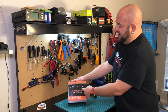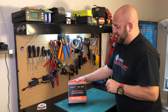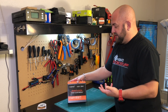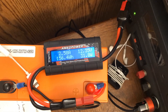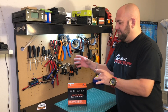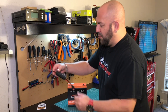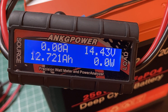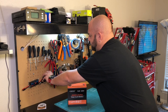This battery is garbage - it just doesn't live up to its potential. I didn't have high expectations, but it's a lithium iron phosphate battery, a 20 amp hour battery. I've done two charge-discharge cycles with it using the 7610 until it drained out, with a camera doing a time-lapse. Using an inline watt meter, I only got about 12 and a half amp hours of current out of it.